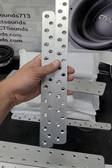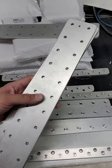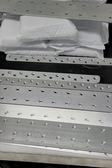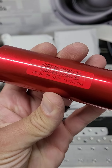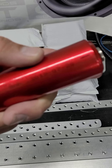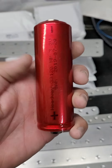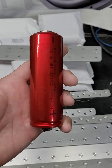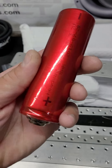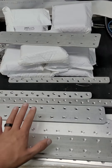I'm going to do a whole video assembling, balancing, and covering everything you need to know to build these cells yourself. You can buy bus bars online — I made mine because it was a lot cheaper. These are Headway lithium 3.2 volts per cell and they are 2019 date-coded. They went down in price literally just last week — I bought all these and then they dropped one dollar per cell, so there's an extra $50 worth of cells right here. Right now they're six dollars a piece — that's a screaming deal and you can build this whole pack for about four hundred dollars.